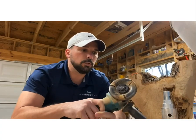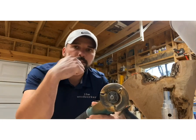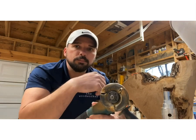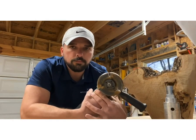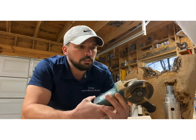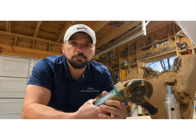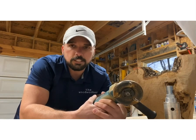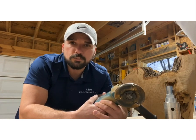The tool actually slings most of the shavings out of the piece you're cutting, so you don't have to continuously clean out the shavings to see what you're doing. You also want to clean the back side because the wood will kind of gum up after a while — the cleaner you keep it and the more you sharpen it, the better it'll continue to do its job. I always wear gloves and I recommend wearing long sleeves, especially when removing bark, because as fast as this thing's spinning it's sending material right back at you.